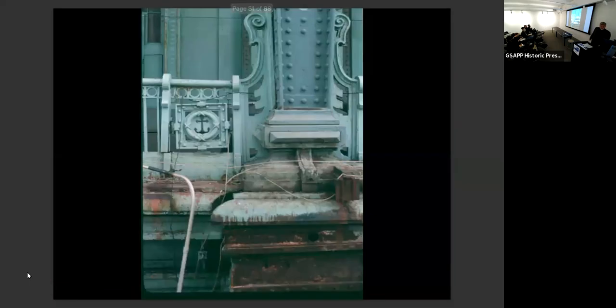Now, one of the big issues for this building was subsidence. Because the structure had deteriorated so dramatically, we had areas, especially in front of the building, under columns, where the building has subsided 2 inches. The structural engineer's Bible is, leave it in place and support it where it is. Don't try to move it back up. So we had to find a way to accommodate the changes in design or in linearity of the ornamental pieces as well. And that required not only a lot of head scratching, but a lot of arguments with the contractor.